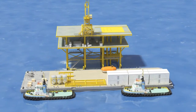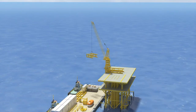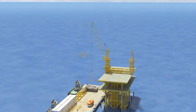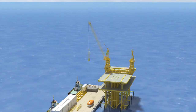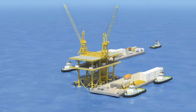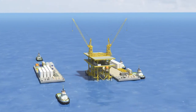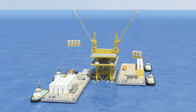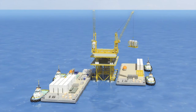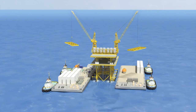As the north main crane is completed, it begins lifting and placing the south main crane foundation trusses and then the components of the south main crane, which has an identical 50 ton lifting capacity. By the tenth day of the erection process, the south main crane is completed and Barge 2 is now positioned along the southern side of the platform. Both the north and south main cranes begin lifting first the P-tanks and then the components for the four levels of living quarters and the helideck.